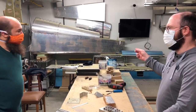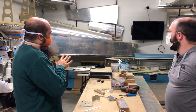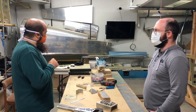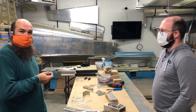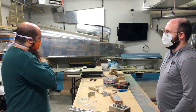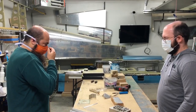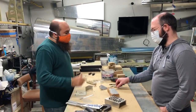The modern RV kits — the RV-12, 14, and 10 going forward — you don't actually have to drill everything to size because they're punched to the correct size already. With the prior generation kits, like my RV-10, all the holes are punched but not to the final size. So you click it all together and drill every single hole — usually with a reamer because it makes a nicer hole — to the proper size. But you're not punching in new locations.